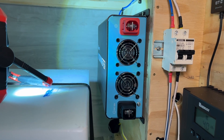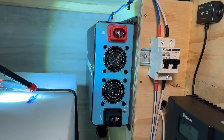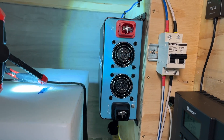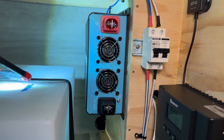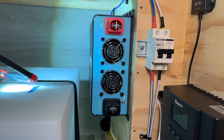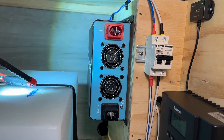The downside of hardwiring is I won't be able to easily reach the switches on the other side. I shouldn't need to switch between 50 and 60 Hz often, and for eco mode I'll take a picture of the switch layout, laminate it, and put it near the wiring diagrams so someone can reach in through the bed hatch and switch it. I'm planning to use the one-aught cable since it's important to have the inverter near the battery — 120V is much more efficient at transferring over longer distances due to higher voltage.